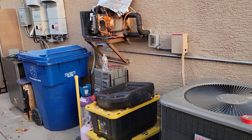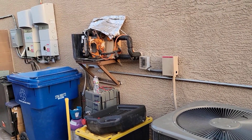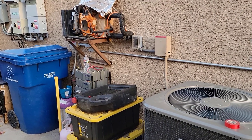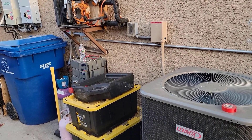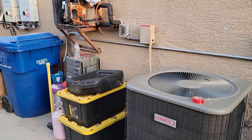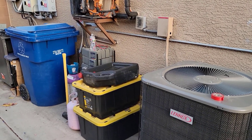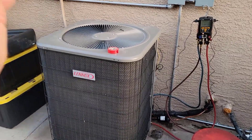What it would be is: for summertime I'll have it send liquid to the high wall instead of to the outdoor coil - the evaporator on the outdoor coil will be redone - so anytime the water heater is running it's going to cool the garage a little bit. And then because I'm going to want it to cool the garage and sometimes I come home in the afternoon and nobody's been using the water, I need a changeover valve to just open up and add a loop - part of the outdoor coil will be condenser coil and part will be evaporator coil when it's winter or when I don't want to steal heat out of the garage. That'll be a cool little project and it won't shut down all our cooling up in our bedrooms.